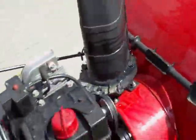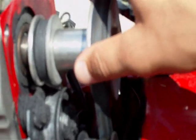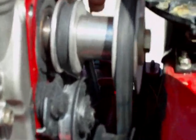Zip her back down — it's a heavy sucker. While I did it, I take my belt covers off and I lube up the pulleys and the tensioners right there. You can see all that dust, that's usual. The auger belt's got ripples in it — not ripples exactly, but it gets better grip when it spins. The auger belt's in good shape still; it's just the drive belt that's a little ate up.